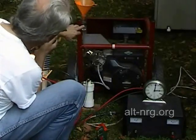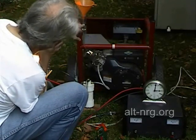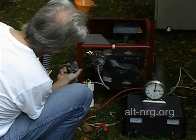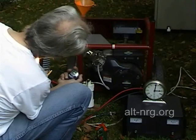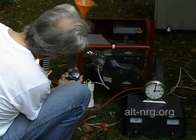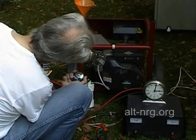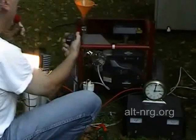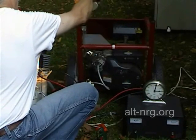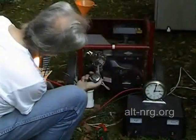There's the level of the gasoline. We've consumed 10 milliliters in 30 seconds. Mark — 60 seconds, 20 milliliters in 60 seconds. Reset the stopwatch, top it off again, we'll do it one more time to give ourselves a good baseline.